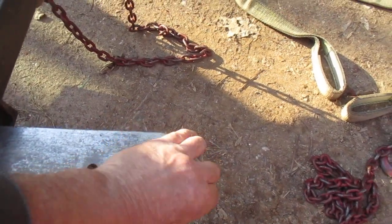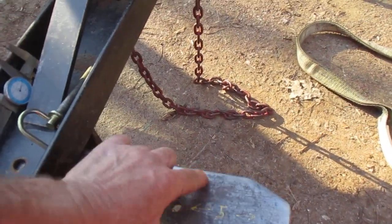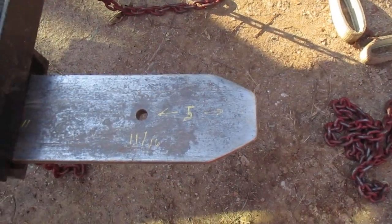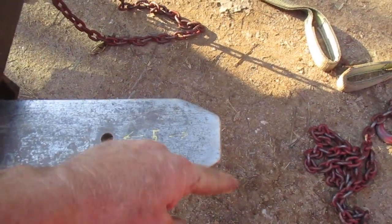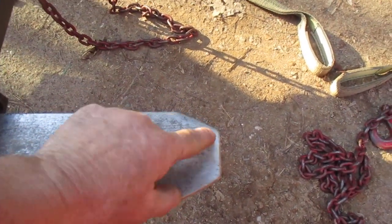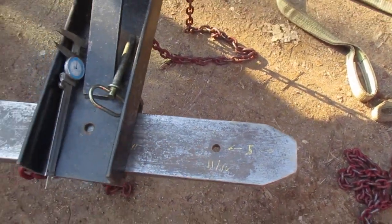The front of the forks are tapered - almost all forks are tapered in the front and narrow at the front. In my opinion, the front of the fork in this area is made as a guide, like a funnel to funnel you into where you're going. So if you're coming to a tight spot, it's going to push the fork over just a hair to get it in. Those are guides - they're not meant to pick up weight.